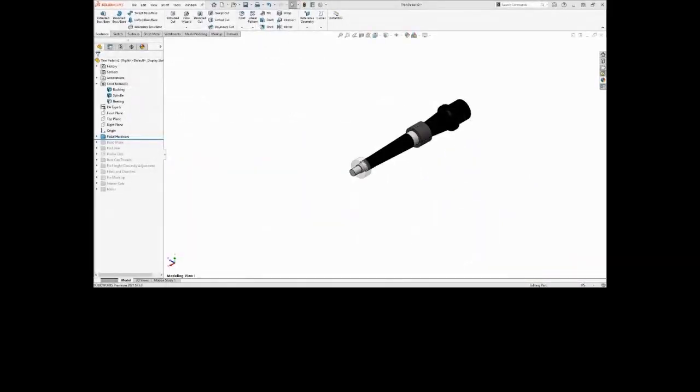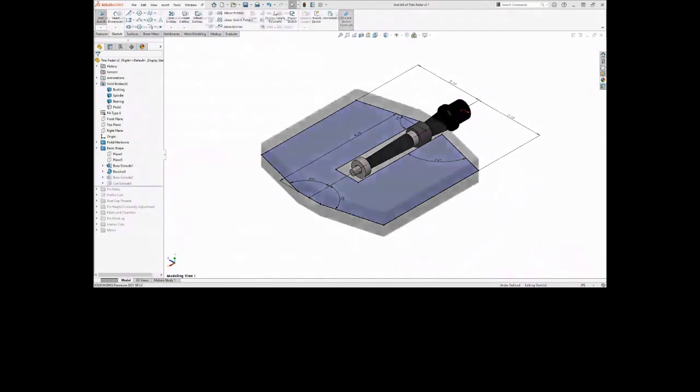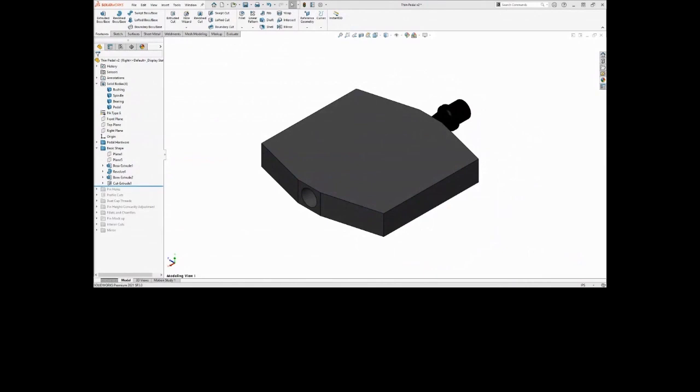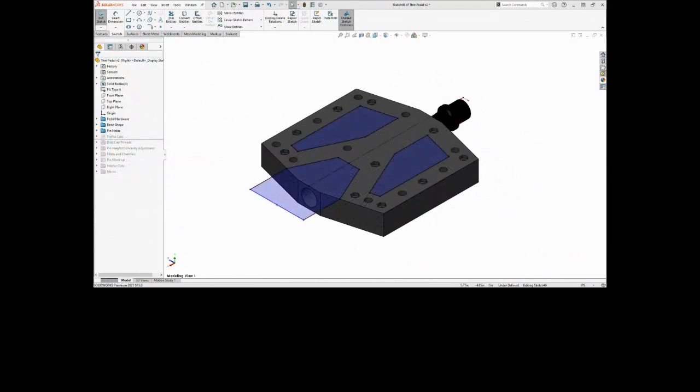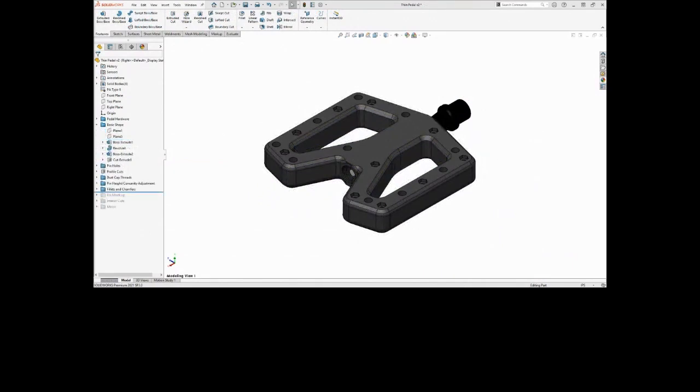So once I had all the parts, I opened up SolidWorks and modeled the critical parts up for fitment. Then I started sketching around these parts, and you're going to notice that I can actually change the shape of this sketch, or if I wanted to get really fancy, I could drive this using variables to customize the size and shape of this to my foot or someone else's foot, because everything is driven off of this sketch, as you're going to see. Once it was done, I extruded the pedal and started to add some other design features. For example, I added a hole and used a sketch-driven pattern based on the shape, added some lightning cuts, and then ended up rounding all the surfaces, again, to decrease the chances of warping and increase print speed, and added some more lightning cuts as well, threads for the dust cap, and chamfers on the top and bottom.